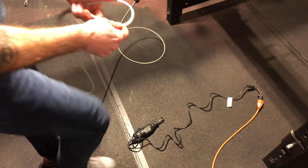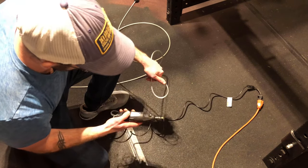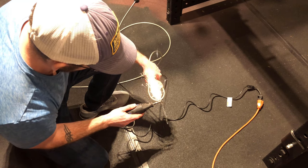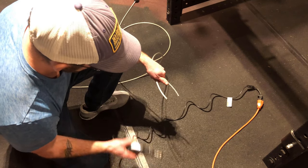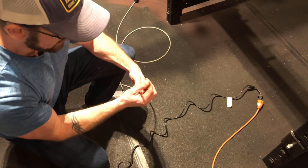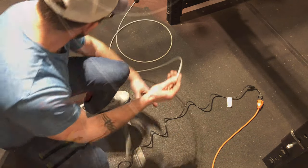Now, since I don't have any wire cutters that are going to cut through this easily, it's going to fray the wire. I find the best way is just to use a Dremel and give it a nice clean cut. So that's what I'm going to do here. Easy as that. If you have wire cutters, though, that'll go through this, and maybe you do because some of them come with the hydraulic sets, then I would use that. But this works well. Next, we're going to take off some of this plastic, and I'll show you a way I find works pretty well for that.